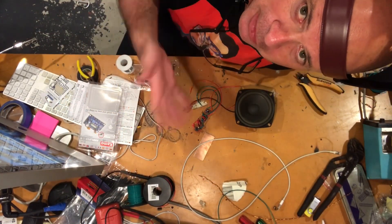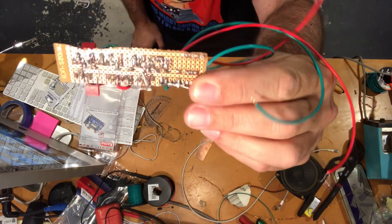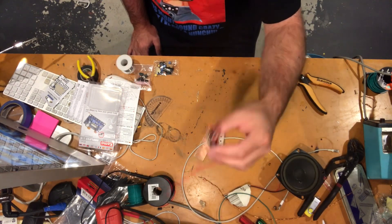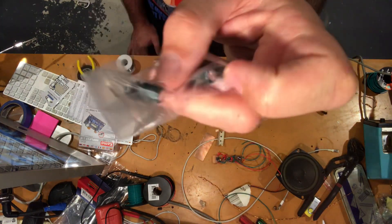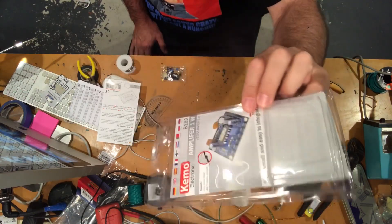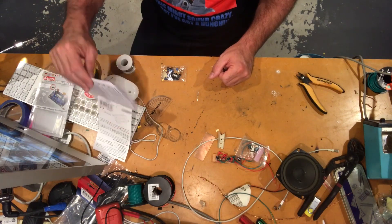It's school holidays and I'm a very happy man - tomorrow is staff lunch and then we're free and clear, so we are hitting the test bench and trying to finish off projects that have been sitting forever. One of those is our audio filter for CW. As per usual the test bench is a diabolical mess. This is our filter with the operational amplifiers on Veroboard. I'm going to test it carefully - I'll meter it out and make sure we haven't made any silly wiring mistakes. It's got a split rail, so it takes 12 volts in and makes 6 volts positive and 6 volts negative.